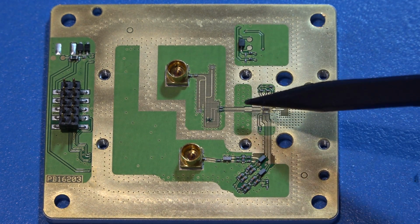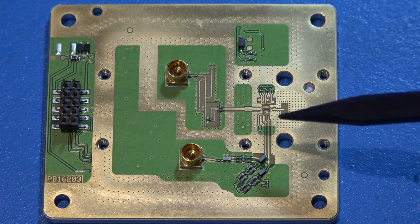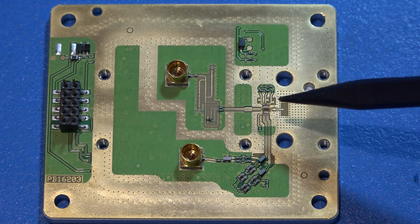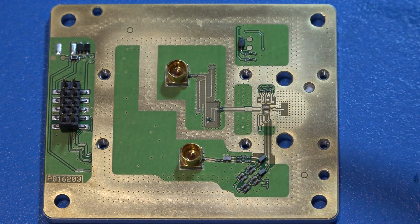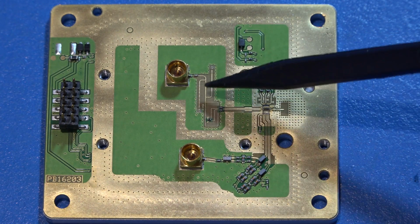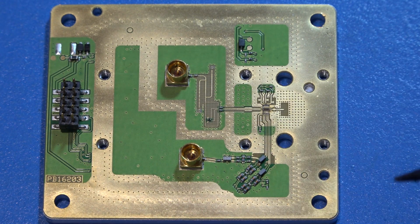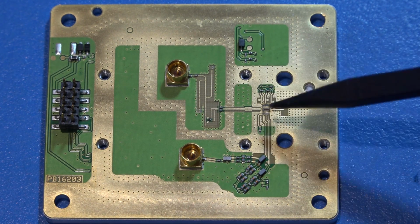It's possible. Now, on the left side, we're going to have the LO input, and if you look carefully, the LO is differential. It's nice to be able to put a differential LO into this IC, and this is most likely because there's a multiplier inside the IC, or there is a subharmonic conversion in the IC. And if there's a multiplier or a harmonic conversion, differential is always useful, which means that this is our LO port. So the LO comes over here. There's some stubs here for filtering and so on, and then we have a single-ended to differential passive balun here with termination resistor over here, and then we got the differential signal directly onto the RFIC. Everything else here is coming in and out, or just DC going on this side.